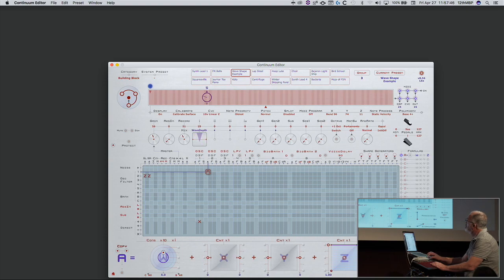Now here's an interesting side effect. If you move this barrel, you're generating a 7-bit value. So you'll probably hear some stepping if you're thinking about that in performance. But you can also control it via a pedal. And what's the resolution there? 12-bit? I don't know, better than 12. And you get very smooth movements.